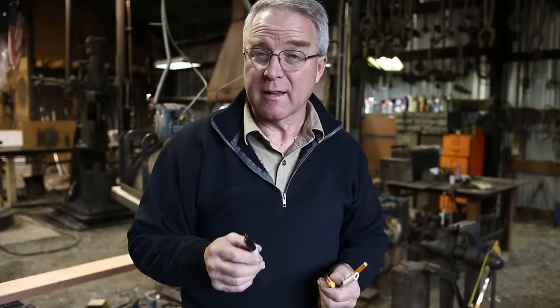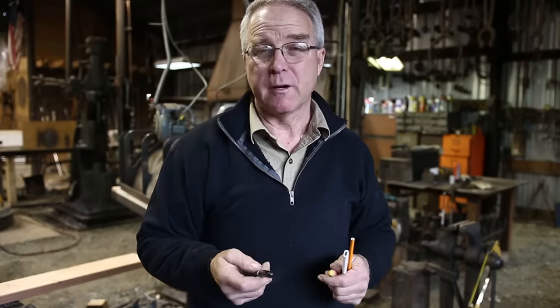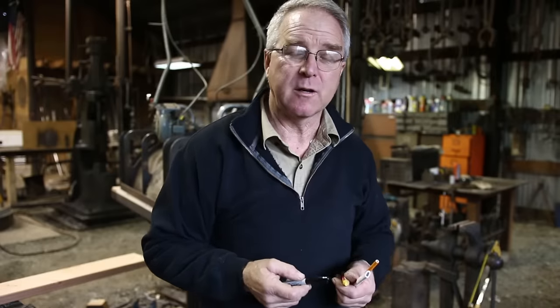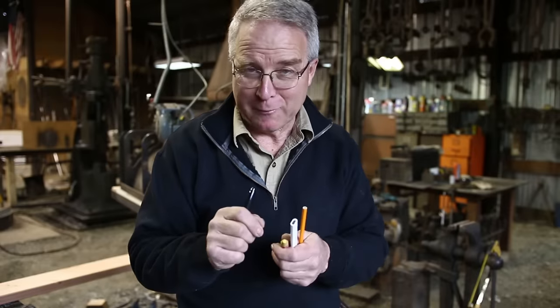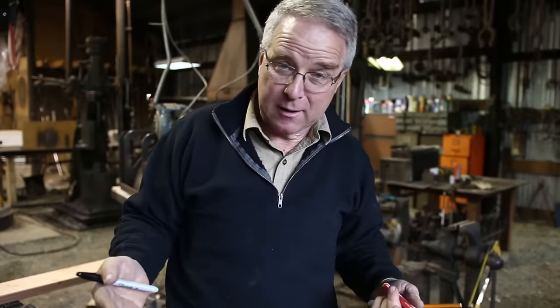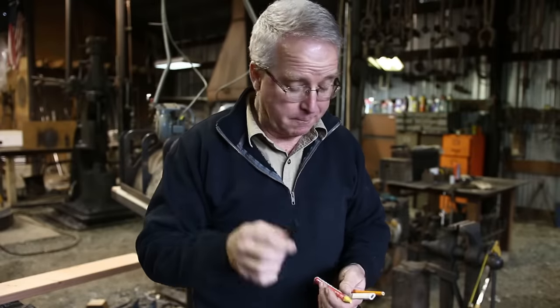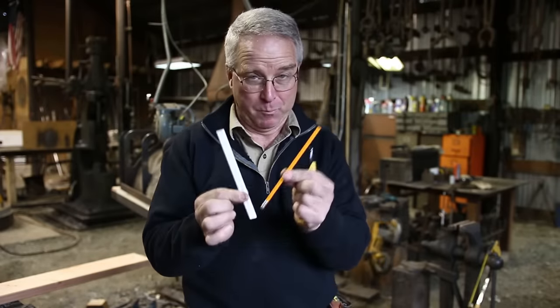Once it's on, it's always on, and it will mark on any substrate. Since it will mark on anything, if you need to mark, for instance, a metal stud or a piece of valley metal, a piece of flashing, your Sharpie's gonna mark it, your pencil's gonna skate. Or if you get a little mark with the pencil, by the time you take your eyes off it, put it back in your bags and then try to find it again on that piece, it's gonna be hard to find. Sharpies are awesome. But we get to the real meat and potatoes of marking for a carpenter, pencils.